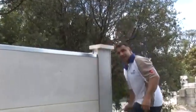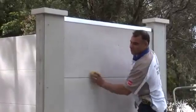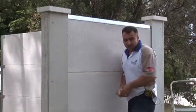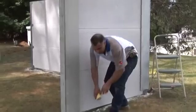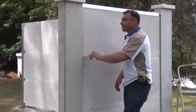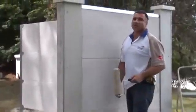Now you're pretty much ready to sand and coat. Go over your joins and give your whole fence a light sand just to take off any loose particles. Then get yourself a quality exterior texture coat. Just like painting, use a small brush to cut in all your edges, and once your edges are done it's as easy as just rolling it on.